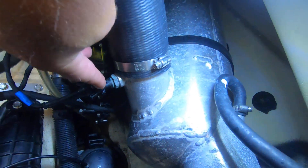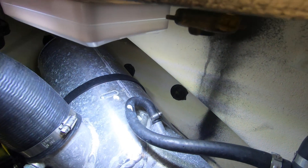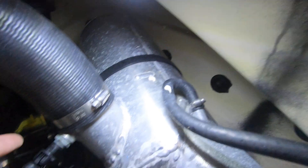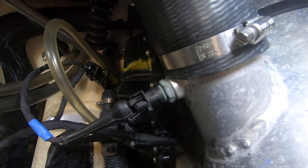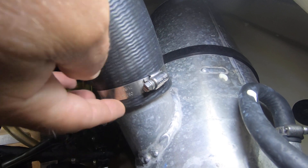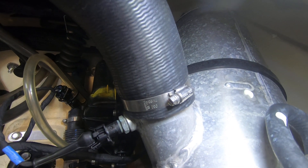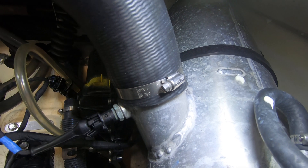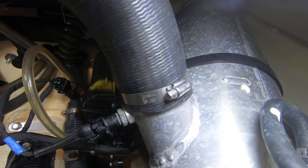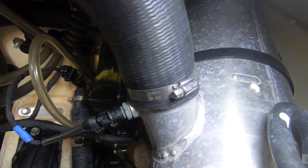When I did my diagnostic check, I found out where the exhaust gas temperature sensor is — it's right here. This is the exhaust box, with this exhaust rubber hose going to the back of the boat, and here's your exhaust gas temperature sensor. What I found after my boat had been repaired is that this hose clamp was just sitting down in the bottom, not attached to anything. I surmise the hot exhaust gas was blowing on or past this sensor, perhaps causing problems with it. I recently purchased another temperature sensor, but before replacing it, I'm going to test the existing one.